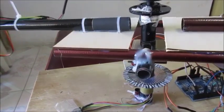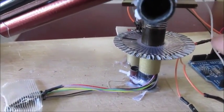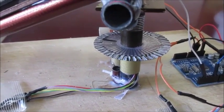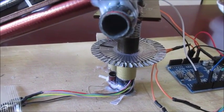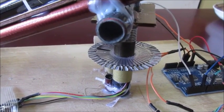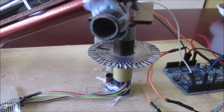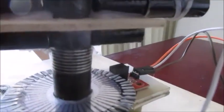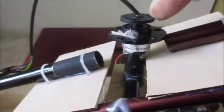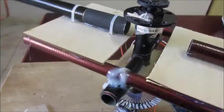It's pretty friction-free — I don't have any bearings in there or anything, I just have a smaller tube inside of a larger tube. Down here I've got my encoder wheel, and this is one of the first things I need to really replace. It's fairly accurate but it's all hand-painted and they're all different sizes. I noticed that if I run 40 or 50 trials I get four or five that have the same top distance, so I need a more precise encoder wheel — I'm going to try to order one or get a 3D printed one. The IR sensor reads the encoder wheel.